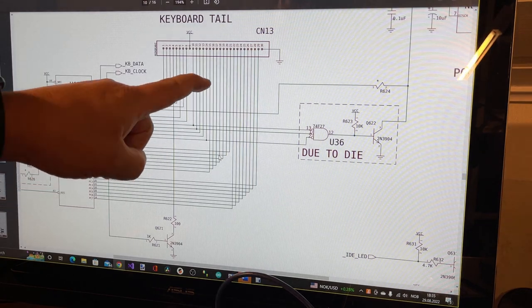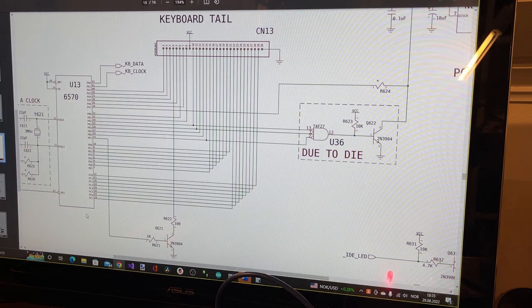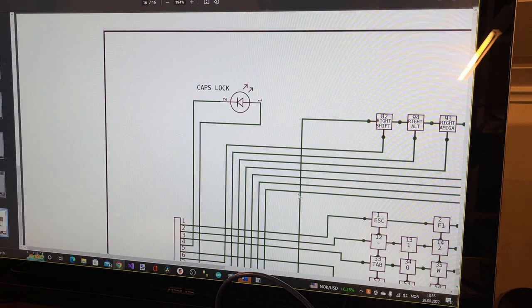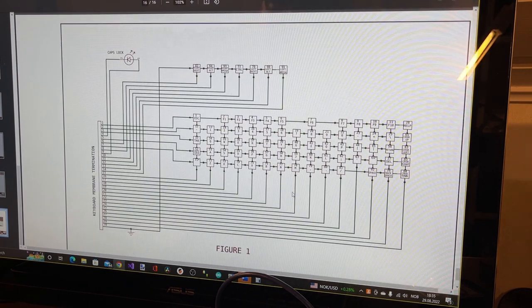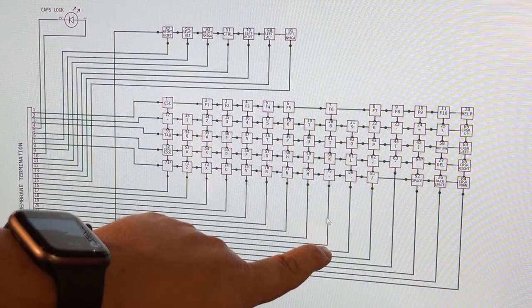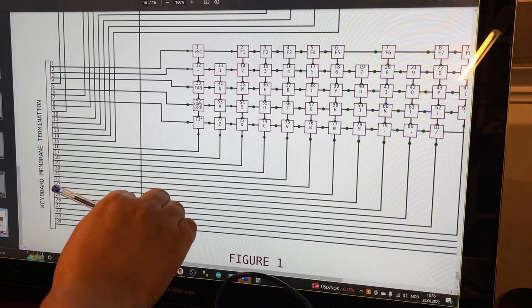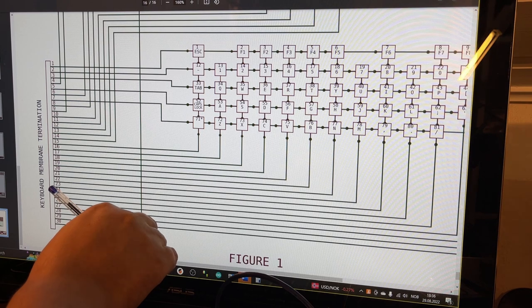But still you don't know which of these lines are connected to which keys on the keyboard, but fear not, the last slide here on the schematics is this one. And here we see all the different key mappings. So we had the line with F6, 8, I, K and the comma, and that's this one here. So this is then pin 22. No, it's pin 23. It's easy to miss by one when you have all those parallel lines.